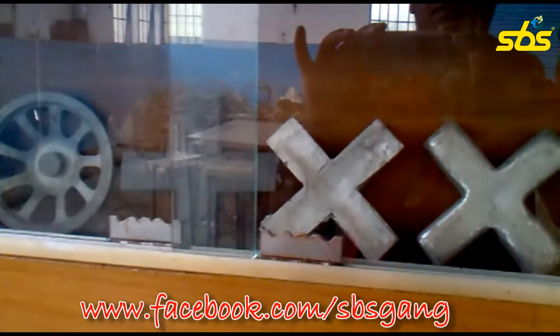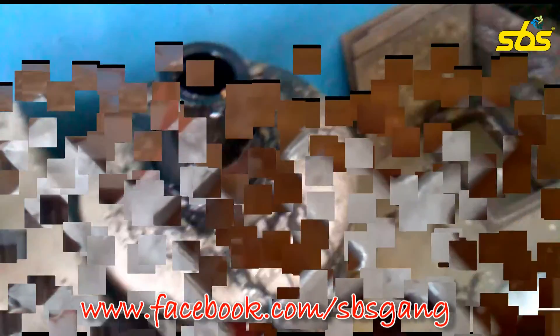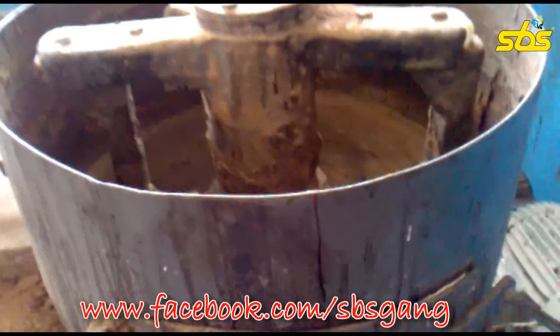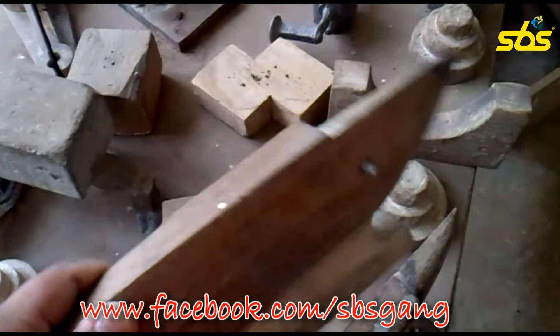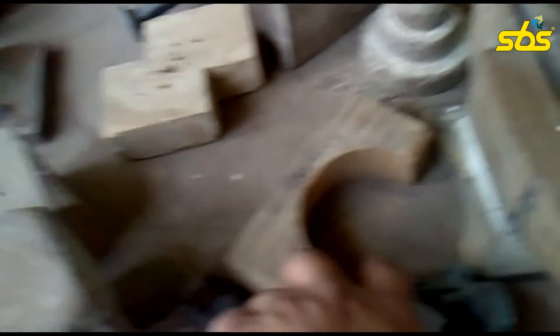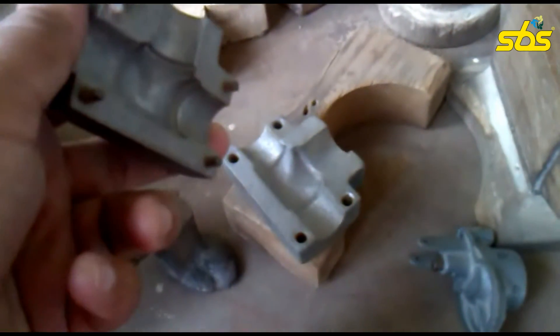The cross sections, the castings made of aluminium — now the zoom view of the castings. Moving on to this section, in this drum we collect the molasses that we will further use. Here we mix the molasses with the sand — the mixture is prepared basically. Now we are seeing the detachable patterns. We will use these patterns later on while making the core inside the casting.